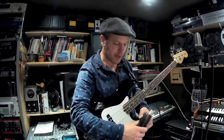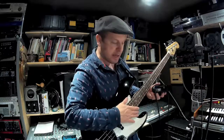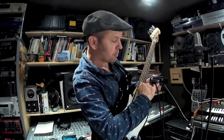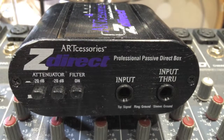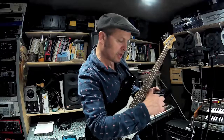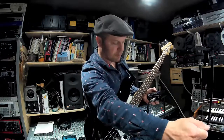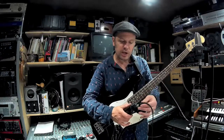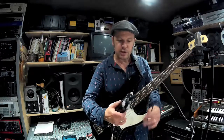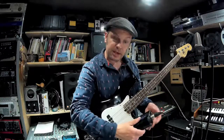This is really aimed at bass players, keyboard players, and acoustic guitar players who have to plug in to amplify themselves. What you would do if you were a bass player on stage is plug into the input, and then there's another jack called a through output — that just taps off the signal from your bass into your bass amp. So your bass amp can be independent on stage while you're sending a nice clean pre-amplified signal to the engineer.